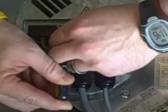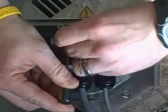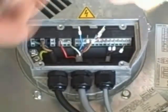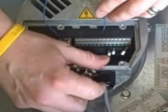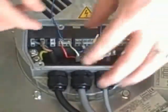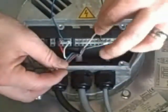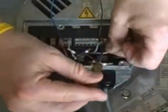One wire goes to your normally closed, the other to your normally open. Take a jumper wire off your common line and go over to one of the 24 volt plus controls — I normally take it off the enable switch. Then wire up your enable switch: in this case our gray and pink wires are the enable switch for the potentiometer control. Gray goes to your 24 volt control, pink goes to the enable section.